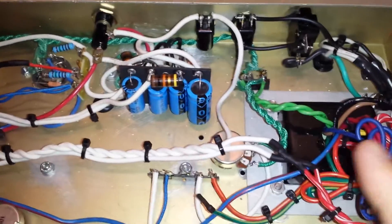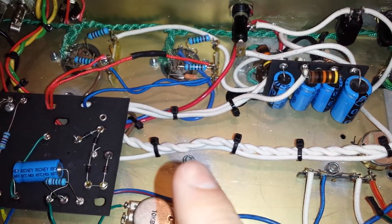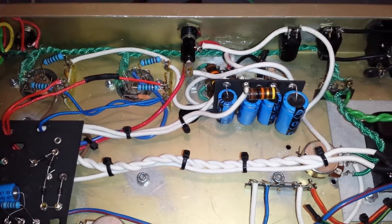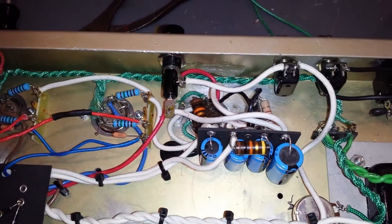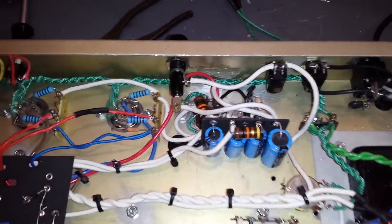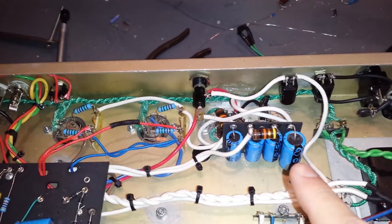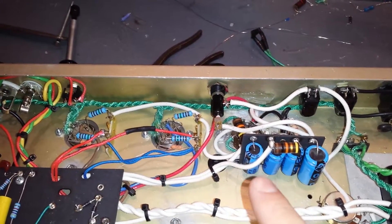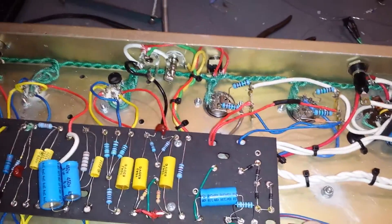My power supply: essentially the twisted pair here is AC into my rectifier, then the rectified DC voltage comes back down into my power supply. It's pretty heavily filtered. That cap can has 440 — well, 240 microfarad caps — and 220 microfarad caps. I've actually increased it with this board here; each one of these is in parallel with each one of the caps in the can for each of my filter stages. So it's pretty heavily filtered.